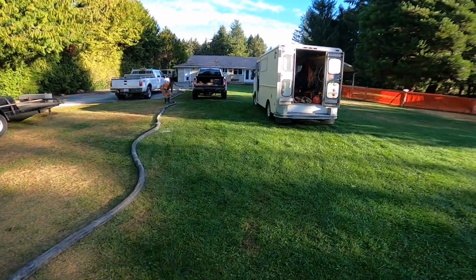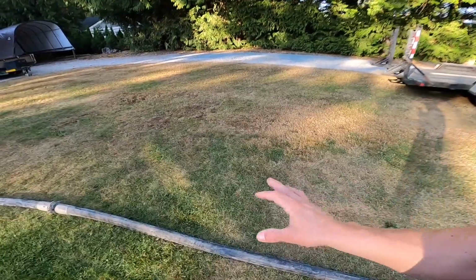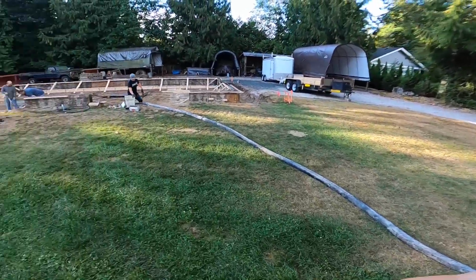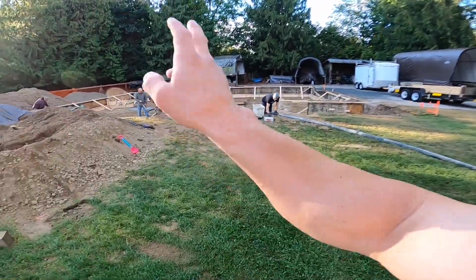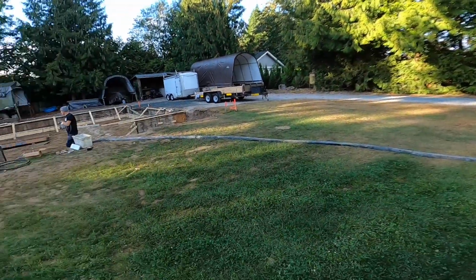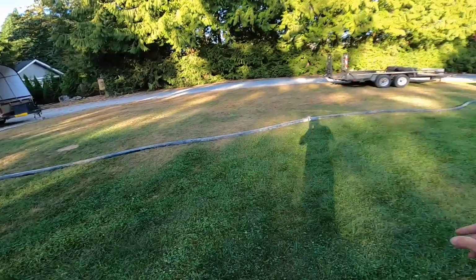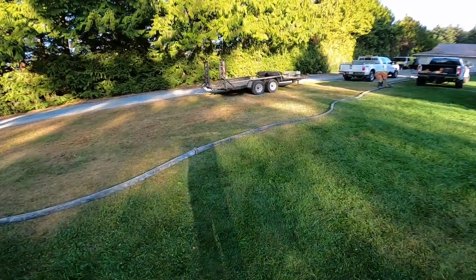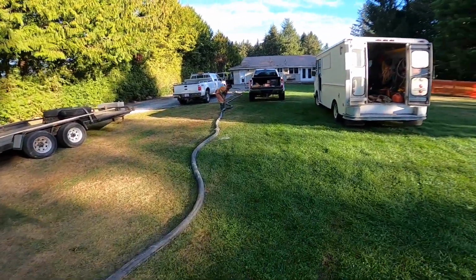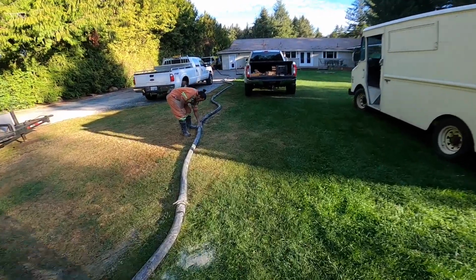So when we break these hoses all off here, doing just the sponge, one sponge, no water, everything is going to be clean except for the last 10 feet of the last hose where the sponge accelerates out of the hose. That will be dirty. That's the one that will need to be rinsed. Everything else, providing that the flanges on the hose ends are clean, can just be tossed back on the rig. So, still got movement.